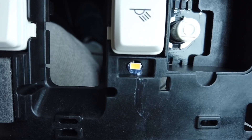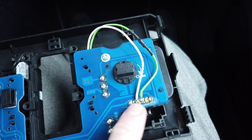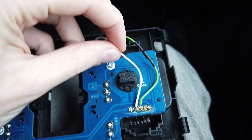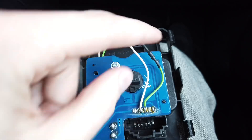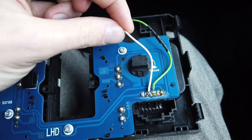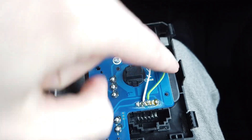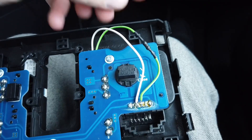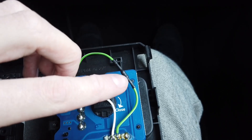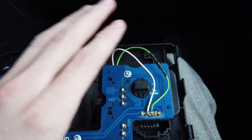I drilled a hole with a 5mm drill, guided two cables through it, and soldered a white LED, then stuck it inside. Then I took those two wires and soldered them to the six-pin connector. The white wire is ground — soldered to the fourth pin, counting from the right: one, two, three, four. The positive wire from the LED is soldered to the third pin — one, two, three — but there is a resistor in between, so I had to cut the wire and add a 7.5 kilohm resistor.